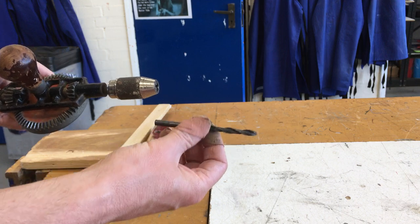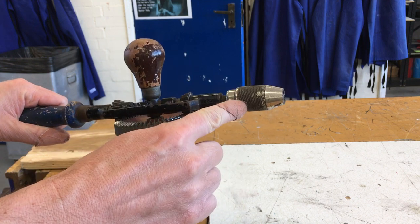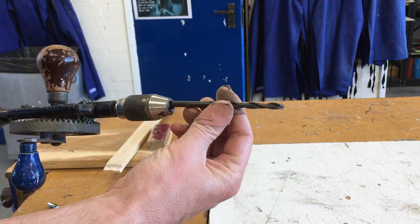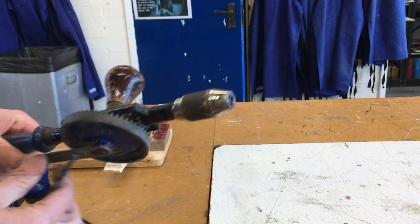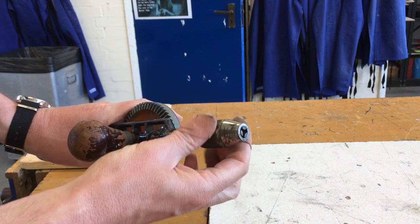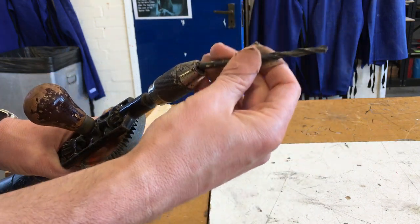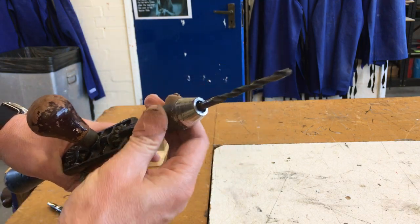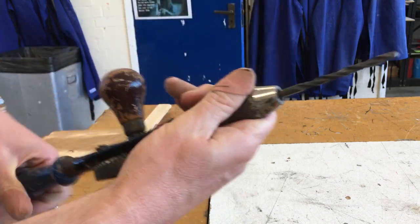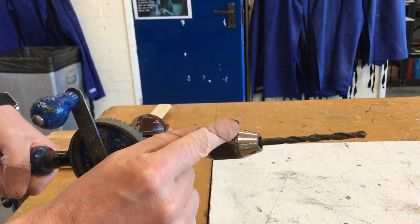This particular model has a handle that goes round, which spins the end of the drill. The twist bit goes inside the chuck. You undo the chuck by holding this handle still and undoing this part, and the three little jaws in there will get wider. Once they're wide enough, you place the drill bit in and do them up again to tighten it. But this part has to stay still — if you don't hold it, the whole handle just rotates around and it doesn't actually tighten or loosen the chuck.